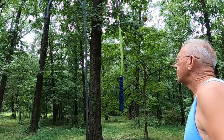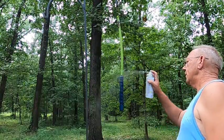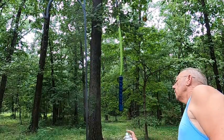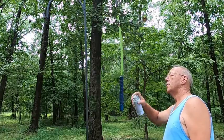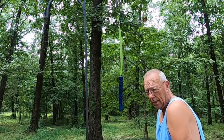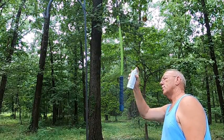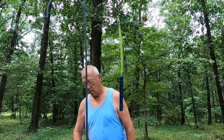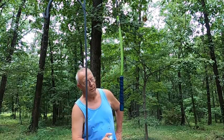This is the fourth coat. What I've been doing is when you put it on, it has a real high sheen. Okay? As soon as that gloss starts to dull, because it's lacquer, you really wouldn't want to do it with a polyurethane. As soon as that starts to dull, you can give it another coat. I think four will be it. I think that's all I want to build up now.